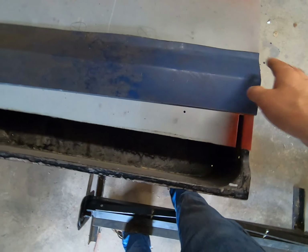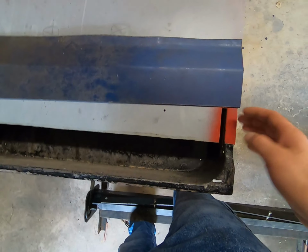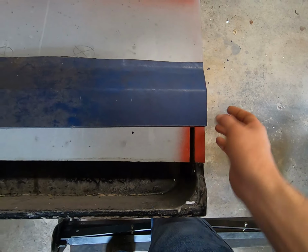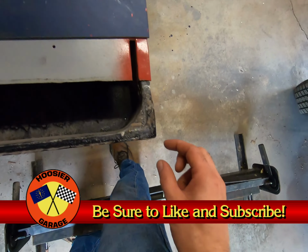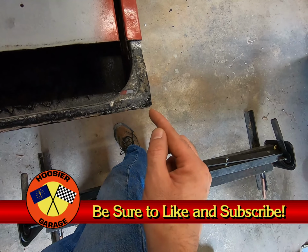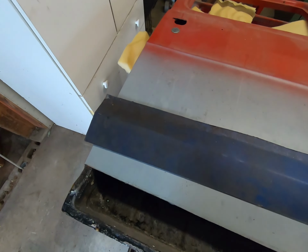and then we'll wrap it around. Now I want to establish a wrap point with the brake on this piece, and if possible we'll probably have to do more hammer and dolly on the ends because the bend will be in the way, but we'll see what we can do. I might be able to get around it by cutting a little notch where you'll have an area hanging over here, but that won't be able to wrap, so we might be able to cut the notch out, and you might be able to wrap it both ways with the brake, but we'll see.